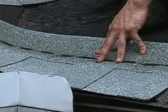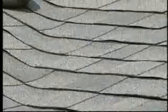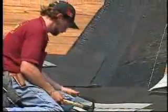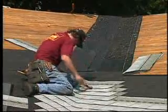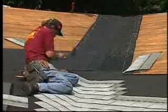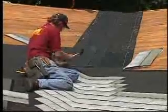The first course is the only course that is woven with the intersecting roof surfaces. Now, apply shingles, assuring that you extend at least 12 inches past the intersecting roof. Don't make a joint in the valley. If a shingle falls short, insert a 1 or 2 tab section or 12 to 18 inches of laminated shingle in the row so that a full shingle extends over the valley. Press the shingles tightly into the valley. Make sure that the shingles lay flat enough so that no bridging occurs.